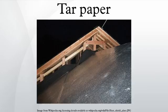Building paper is manufactured from virgin kraft paper, unlike felts, and then impregnated with asphalt. The longer fibers in the kraft paper allow for a lighter weight product with similar and often better mechanical properties than felt. Grade papers are rated in minutes, the amount of time it takes for a moisture-sensitive chemical indicator to change color when a small boat-like sample is floated on water.